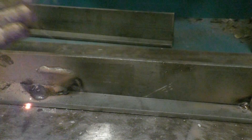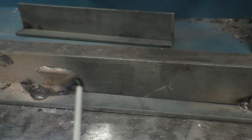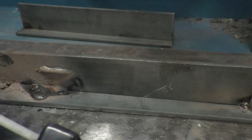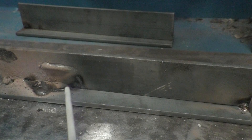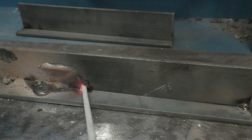She's stuck. Without hitting the camera, I can just snap it off. The danger in that is that you may get arc strikes on your work. So if this was a production piece, I would not want to do that — I would want to disconnect the tongs. That will arc out my electrode holder and eventually damage it to the point where it has to be replaced. I'm welding scrap. See how that bare end is glowing orange? That's just going to make it harder to strike, and my angles are all off because I'm welding under the camera.